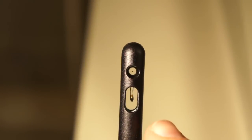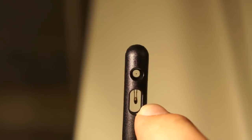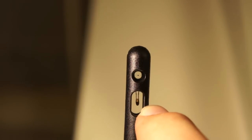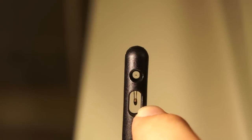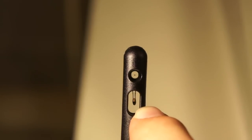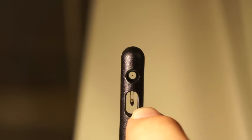The Field Piece STA2 has two sensors. The bottom one is a thermistor that measures temperature — it gets dry bulb temperature and also adjusts the air density reading for changes in air temperature. Air temperature has the greatest effect on air density, so Field Piece uses that measurement to adjust it. However, it does not compensate for humidity and barometric pressure, so in areas of very high elevation or extreme humidity you may need additional adjustments. For most technicians, temperature compensation handles about 95–98% of measurement inaccuracy.